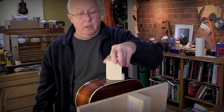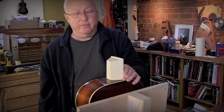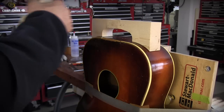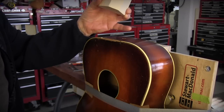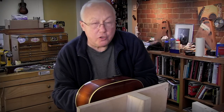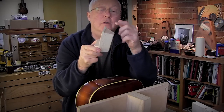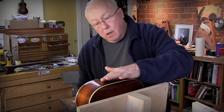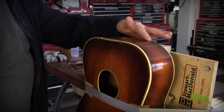The first thing I did on this job was take some 2x4s, smooth the surface and glue up a block - that took about 35 minutes to dry. At that time I made this caul, so I kept moving the whole time. After about 35-40 minutes it was dry enough to bandsaw to shape. The whole idea here is that this passes over the shoulder brace - that's how thick it is. It doesn't touch the real neck block; it pokes it at the top. So all the pressure came here and I was able to take a real sag out of the shoulders, and it's almost the same shape as the bottom edge now.